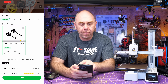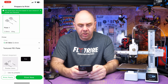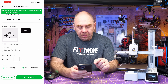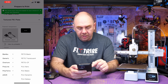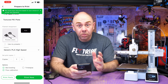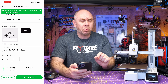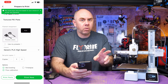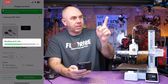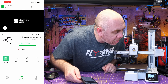To print this is really quite easy. We're going to select Print, select A1, and click Print down here. We want the A1 Mini textured PEI plate, and then we're going to select the filament — Generic PLA High Speed. I'm going to leave the time-lapse option off, because if I leave it on it keeps moving the head out of the way and it slows everything down. So I'm simply going to click Print now, and that will send it to the printer. It's kicked in — what that's going to do now is download it to the printer and start the pre-actions.